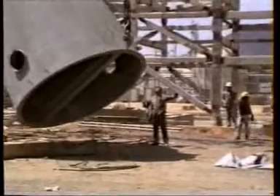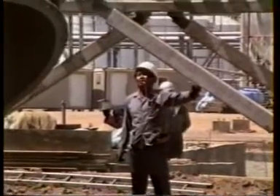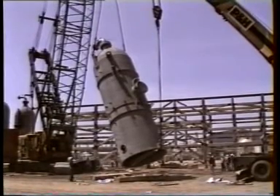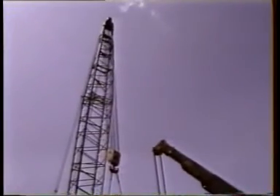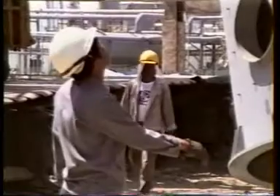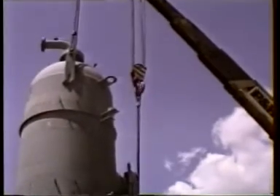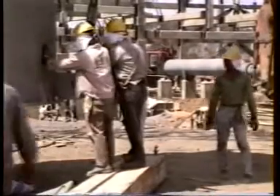This story repeats itself over and over again. Connect the main lift crane to the top lifting trunnions and the tail crane to the tail arc. Lift the column out of the transport saddles and gradually move it from the horizontal into the vertical. Make sure that both crane lifting tackles stay vertical during the entire lifting procedure. Then release the tail crane and slew the column above the foundation and place it over the foundation bolts.